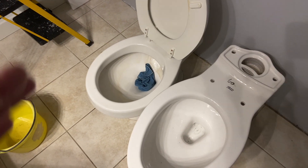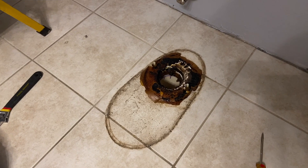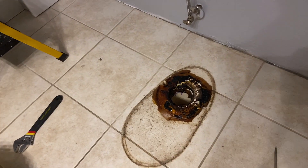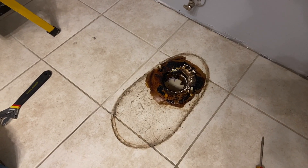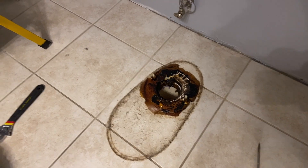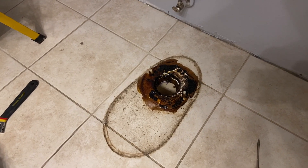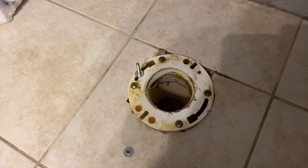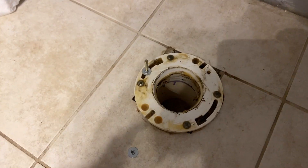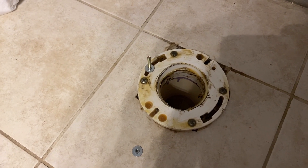So let's take those nuts off and get that old toilet out of here. This is right after the stool was removed. I've got to take those plastic little bolts out and clean this up, because right now that has got sewer gas coming up into the house — there isn't a trap. So we're going to get on this really quick, and if it's going to be off for very long, we'll put a plastic bag into the hole to keep the smell from coming up. It took almost half a roll of paper towels. There's not a lot of cleaners you can use — you can use an all-purpose cleaner on the outer edges, but the wax is just elbow grease and paper towels.